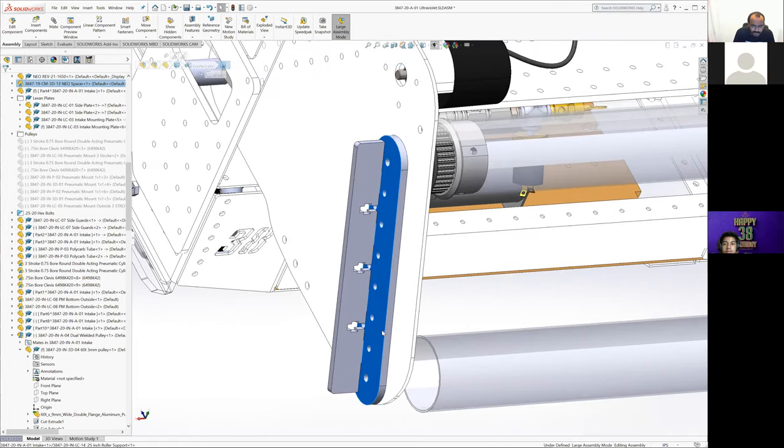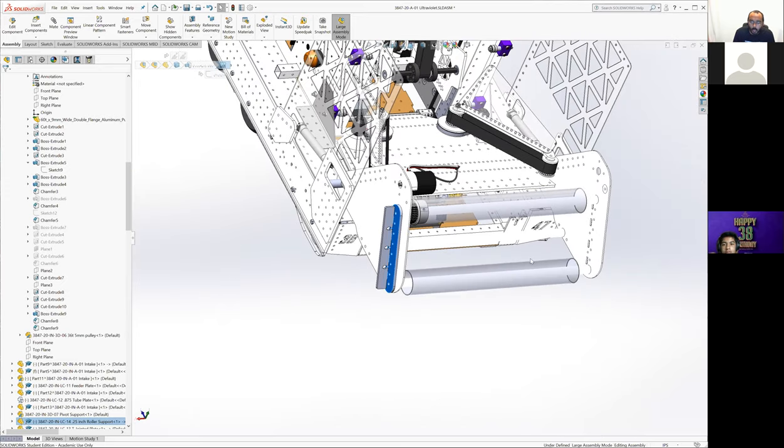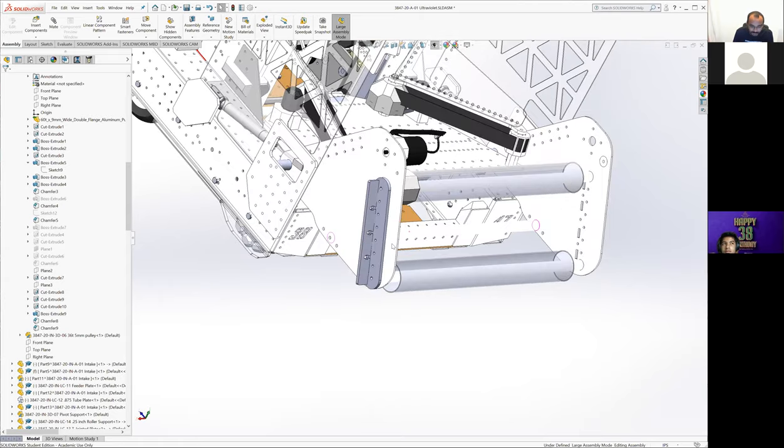We didn't run these at an event, right? We didn't have these at Dripping Springs. No, they were replaced, developed after, because when we ran into the loading station, we would collapse it. Yeah, and when we ran into the uprights for the rendezvous point as well. So anytime we dead-centered hit our roller, if we ran into anything, we would collapse these side panels enough that the belt could slip. So this belt running down here would lose tension and run over either to the inside or to the outside, and it would stop this roller from intaking, which is a giant problem because you can no longer intake balls during the match.